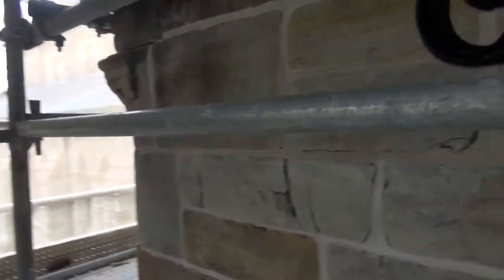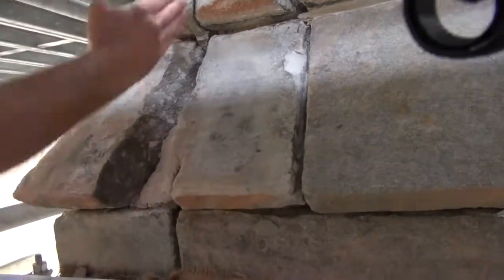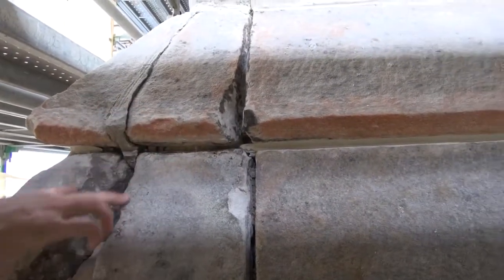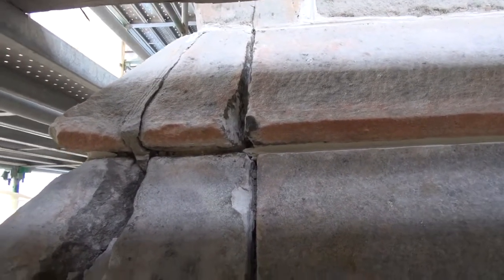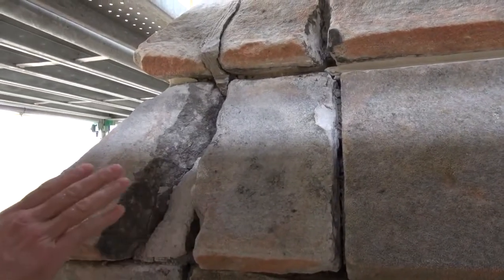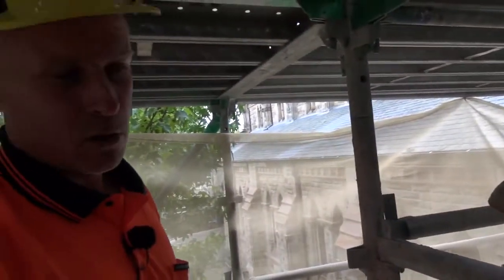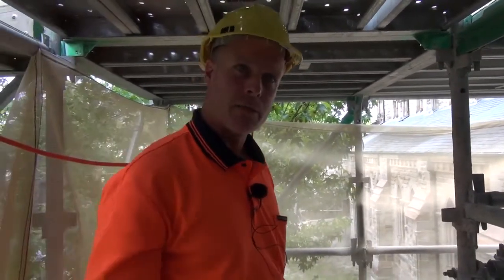This is an example of where the south west buttress is moving to the west. You've got loose existing mortar and also a large chunk of stone that's actually fallen out over time. It's not as bad. Usually on a building, the southern facade will be the worst — it takes a lot more wind, a lot more rain. When the sun goes into the northern hemisphere, it stays cooler and damper. So this one isn't as bad and doesn't need as much attention as the south east buttress.